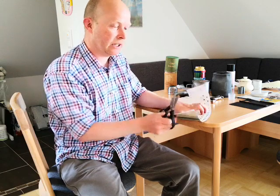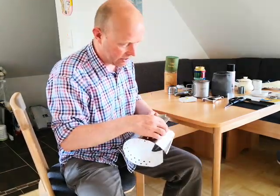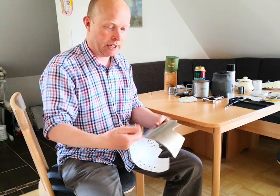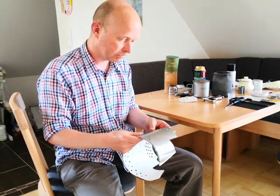But of course it wrecks the aluminium. Because this is titanium, much harder, so they won't be much good for anything else other than cutting more titanium once you've used it. That's fine, they're only about a tenner or so, so that does the job there. So you've got it all cut out. You'll notice some here, it's a bit tricky getting around these corners, so I had to flatten it out. I used just a pair of flat pliers and yeah, it flattened out very nicely. I'll sand some of these rough edges off later.